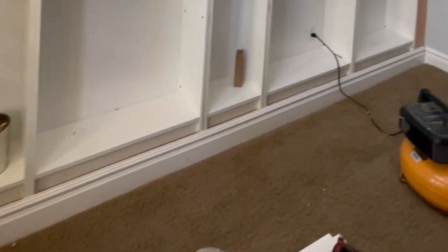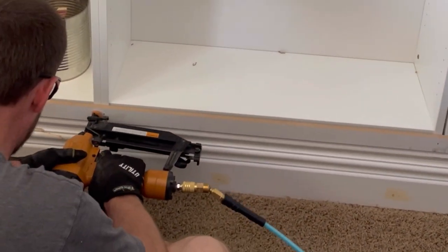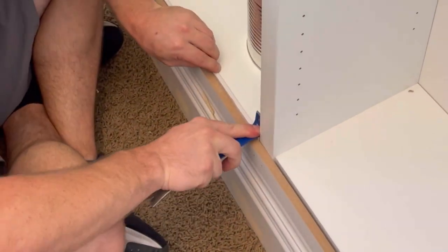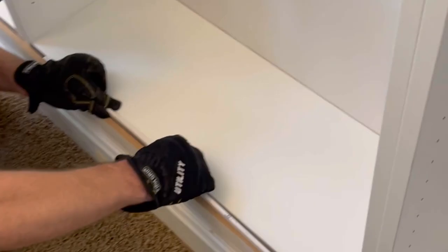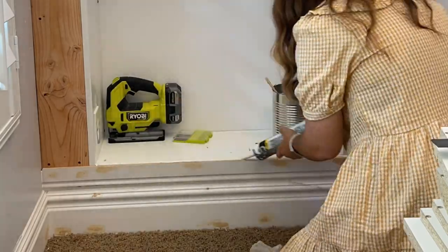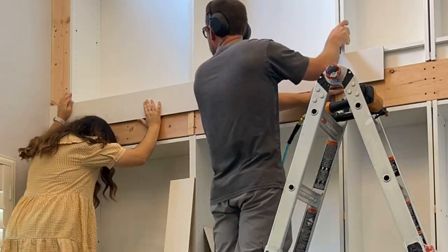The side pieces of baseboard need to be cut shorter and nailed back into place — this immediately makes it look much more finished. To accommodate the height of our base we needed a second baseboard on top of the original. There was a gap between the baseboards and the bookcase because of the Billy bookcase design, so we cut a very skinny piece of trim to fill the gap, nailed it in, and used a little caulk to finish it.